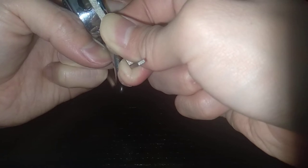Okay, as you can see, the aim is to rotate the lock exactly in the way that you operate it: rotate it three times full rotation clockwise until you reach the first number, and then rotate it anti-clockwise one full rotation, reach the second number, and then clockwise again to the third number without a full rotation. So use the same way, and your goal is to make sure that all the grooves can be seen through this hole, all aligned together.